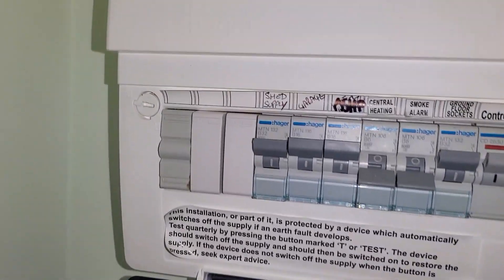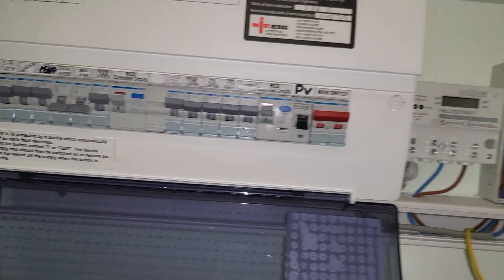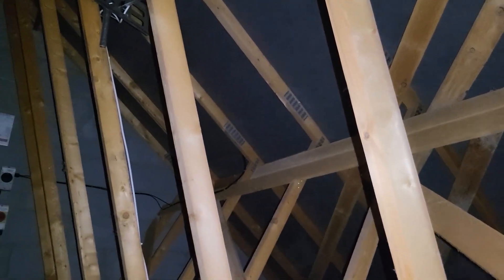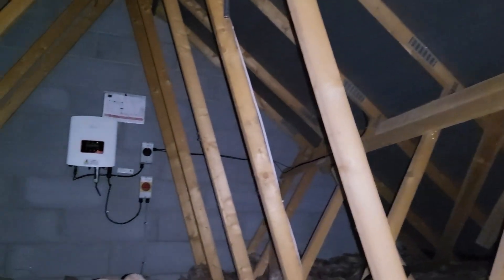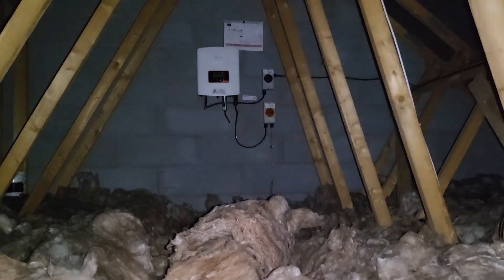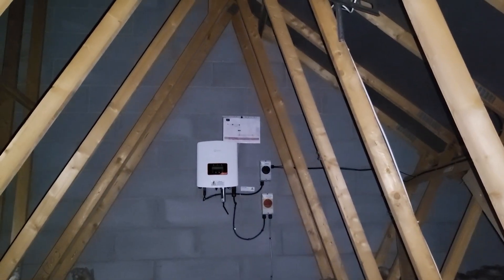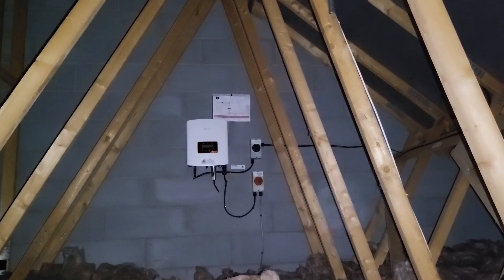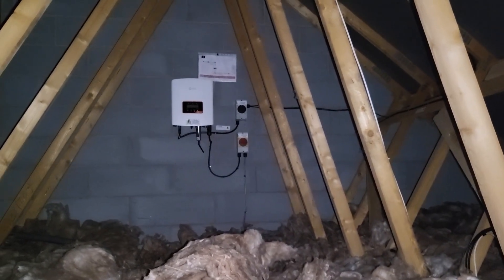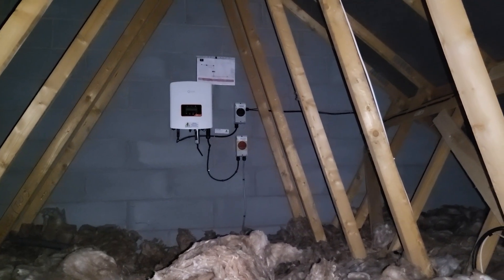We do have a hole through to outside which takes the AC up to the loft space, and we're going to run our cables in the opposite direction bringing DC down to this cupboard space. Up in the loft there is no boarding, no loft light, no loft ladder, and most definitely no smoke detection — so this is a bit of a grey area in terms of compliance with MCS. We're taking this inverter out of the loft space and installing a hybrid inverter and battery storage system on the ground floor in a more accessible position for the customer, also factoring in some element of control around the propagation of fire when using batteries inside somebody's home.